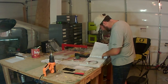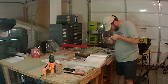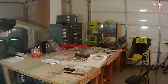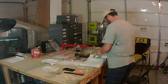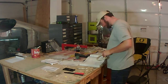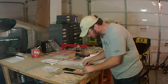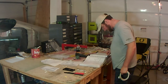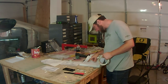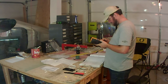Here I'm working on the autopilot wiring harness. As is typical, the electrical schematics in the plans aren't necessarily up to date. If you're working on the electrical wiring — I ran into this with the rudder wiring harness too — go to Van's website and download the actual wiring schematics for the whole plane. It has the updated connector lists, which is what I ended up using to clarify where to connect things. Unfortunately the video ended before I finished wiring the autopilot harness, so my next video will be working on the flaps.